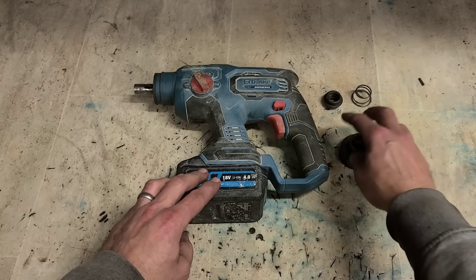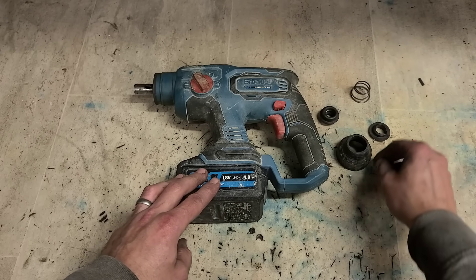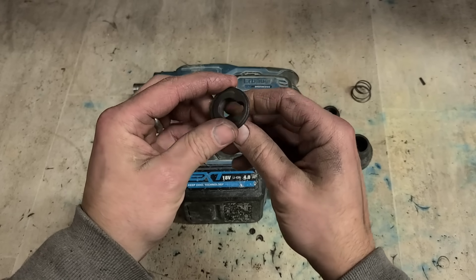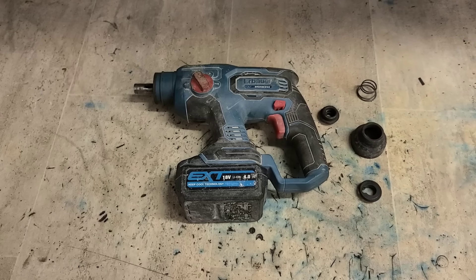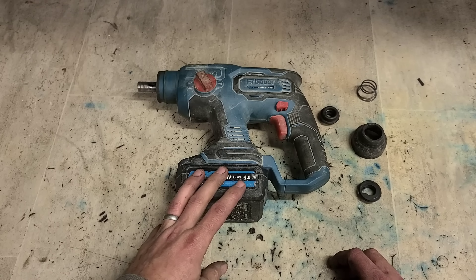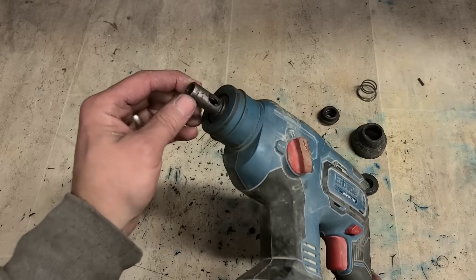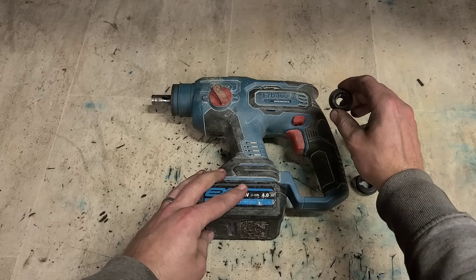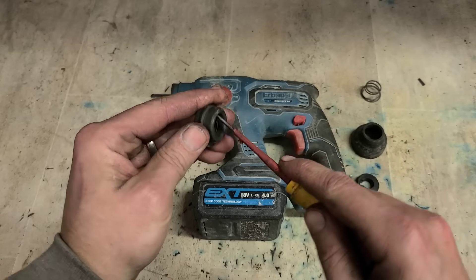SDS drills, no matter if it's a cordless one or a corded one, it's always a 7mm steel ball — whether it's one or two balls as well. The holder, the cap, spring, and the sleeve — the actual ball holder. It's very, very similar to the Bosch. Now I've never actually worked on one of these before, and I've never worked on one of the chucks before, so the question is what else is missing. The ball's missing anyway, and I suppose the clip for the top's missing. There'll be some sort of pin or clip for holding this chuck together. Actually no — there it is there, it's still inside the cap.